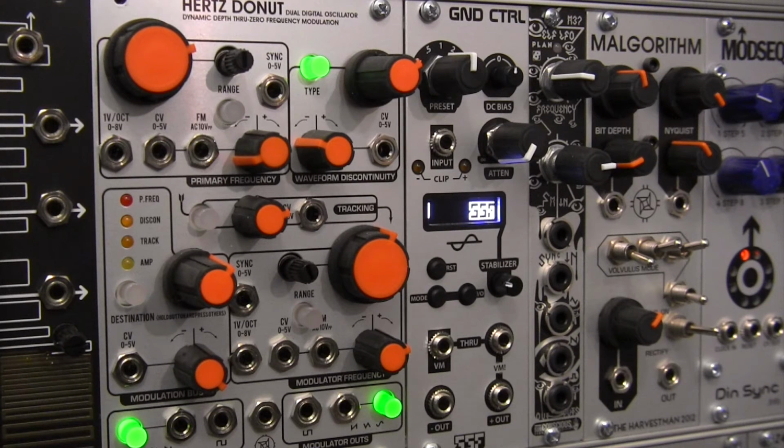One important note is that your inputs may be used simultaneously. Although only one signal is metered, if two signals are patched, the direct input takes precedence on the display, while the processor input can continue to be used for attenuation purposes.